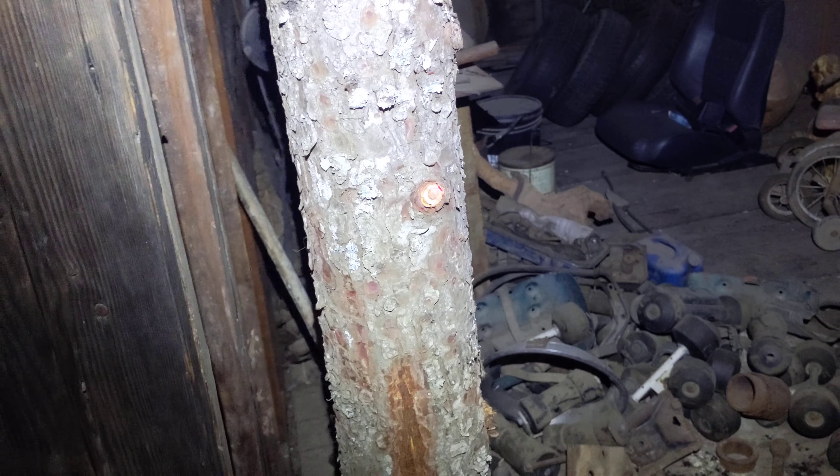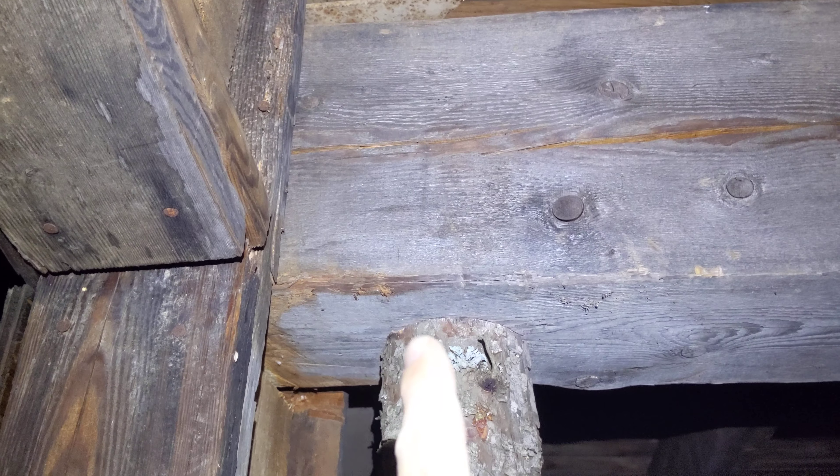You can see the crack down there — it just ripped the wall out and broke away. That's why I have this come-along on there holding the wall together right now. The main thing is to support the weight of the house on these beams and not through the wall studs. When I jack it up in the middle, it transfers the force all the way through the post on all three floors.